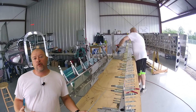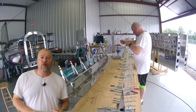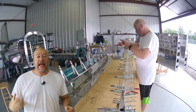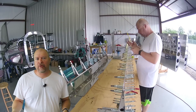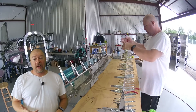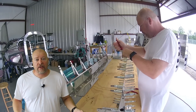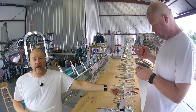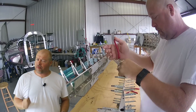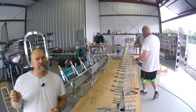I talked about previously in one of my former videos — I'll put a link up here — about a mistake I made when making this trailing edge. I had actually imparted a bow in the edge due to my table not being perfectly flat. I won't do that again, now that I know that's a problem. A couple people have asked about what this table is — it's just an 8x4 piece of plywood. I've got a 2-foot extension on one end, and I thought I built it fairly robust, but I just need to add more. You can never be too sturdy.